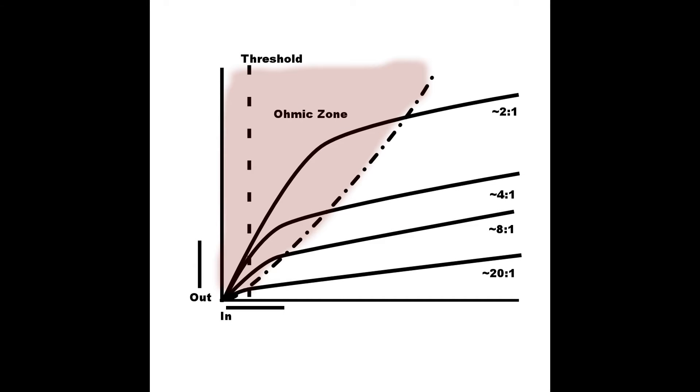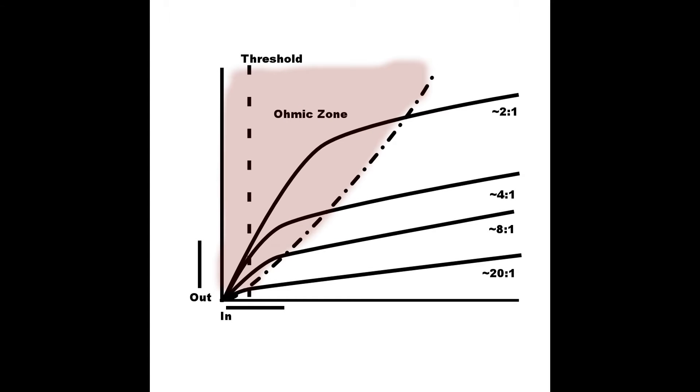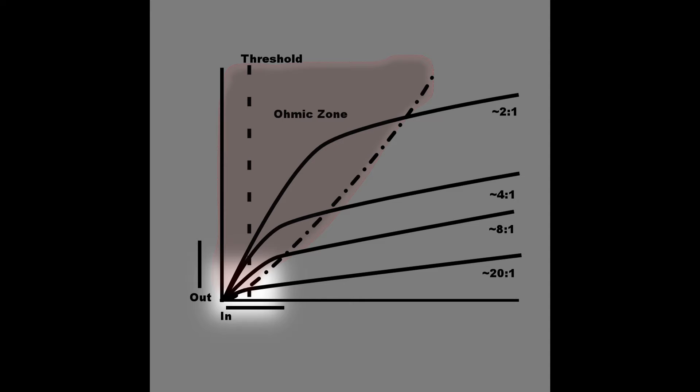The FET 162's sort of factory design is built around this concept. But perhaps the biggest difference is the change in knee shape. We looked at the nonlinear compression curves of FET designs in the last video and saw how these devices change the ratio by lowering the ceiling on these curves, which compresses this soft transition region. It's important to remember that while now all-buttons-in is as ubiquitous as the 1176 itself, it was originally more of an exploit of the design that was not intended for use — but easy enough to mod without even opening the case, since the ratio buttons just lower the operational ceiling of the circuit. What happens if we press them all in? It compounds them all together, giving us a higher ratio, but perhaps more importantly, squishing the operating region down to where the knee is the most feasibly hardest for a FET design.